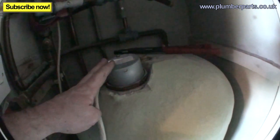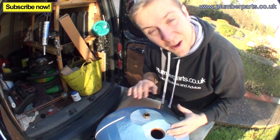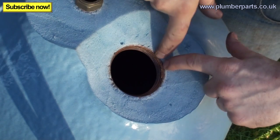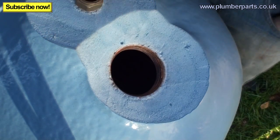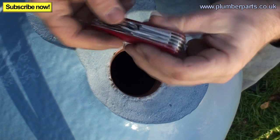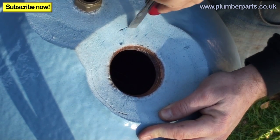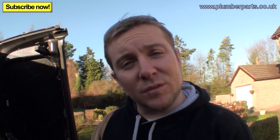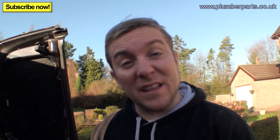Generally when I'm changing these, it's worth putting a new immersion heater in. At the moment we're draining down the actual hot water tank itself. We've valved off the cold feed just up there and we are now draining it all down. Once we've done that, we're then gonna have to drain down the heating system as well, so make sure that's all turned off. While we're waiting for the tank to drain down, what I usually do is get all the bits and bobs prepared on the new tank. Looking at the new inlet for the immersion heater, the immersion heater needs to seal on this flat face that's been covered up by foam. Get a knife and cut the foam back a bit, remove it, then get some emery cloth in there, rub it round and give this a good clean. If you want to know how to install an immersion heater into an indirect or direct cylinder, or a vented or unvented cylinder, just go back to our channel, type in 'change immersion heater' and you'll find our video there.